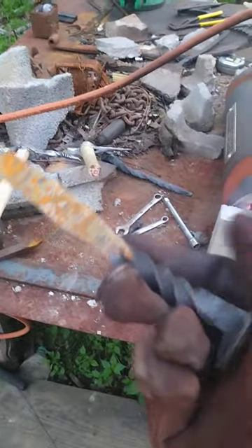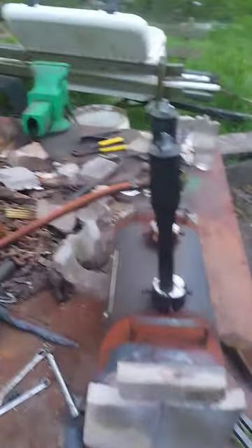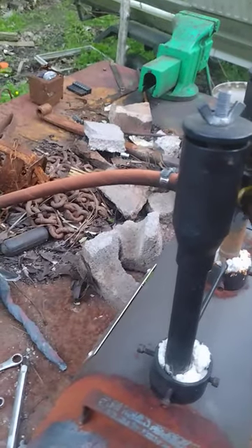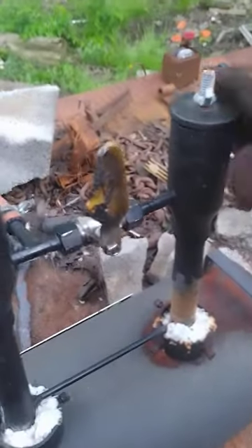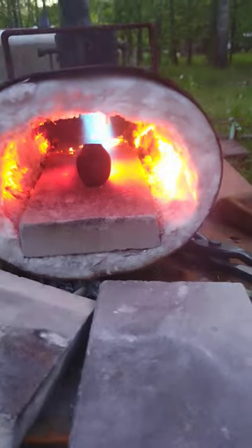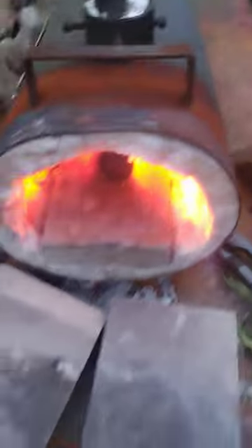Take that a couple of minutes to come up to temp. This is another type of knife we make here — these railroad knives, they're real popular. I'll do a series on making them one night. As you can hear it pulling there, it may need to adjust our oxygen intake. We're going to switch that over to one burner. When it's coming from the factory, they're always turned all the way down, and you turn it on, you're just going to have a yellow flame. You open it and that's how we get our blue flame — that's what we're looking for. It's picking up real nice. That blue flame, that's our hot — that's what you want.